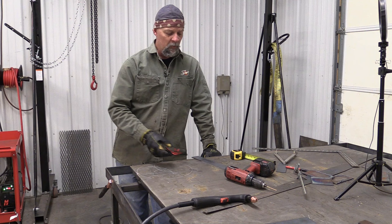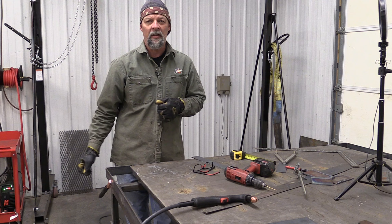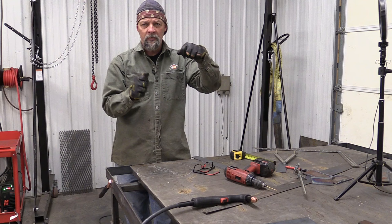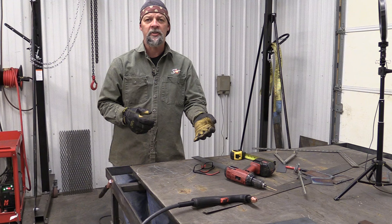The damper I'm going to show you how to build today is a pinwheel damper, and where you would see a pinwheel damper is on the firebox door. It's a round damper and it sometimes looks like it's got two holes in it across from each other, like pie-shaped holes. You rotate the damper, whichever direction, to open and close it. By opening and closing the damper, you can control your temperature by controlling how much air gets into the fire. Closed is cooler, open is hotter.